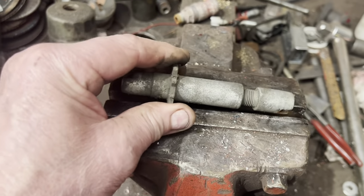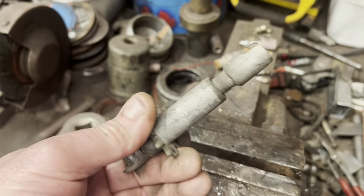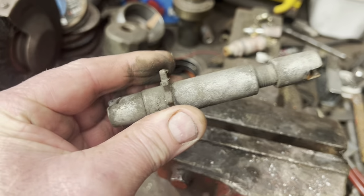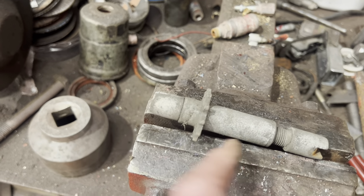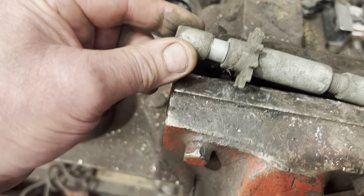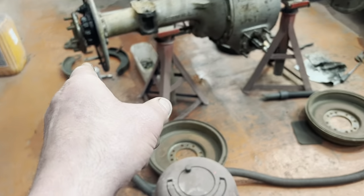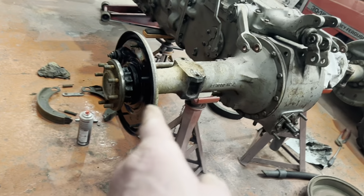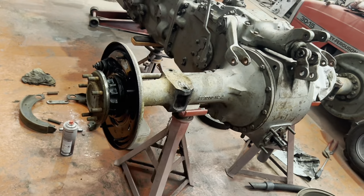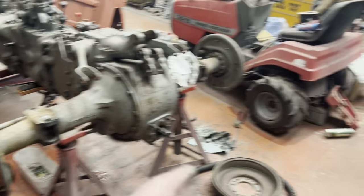So back on the 135. Well, we've been on the 135, but we got the adjuster for the brakes. We'll get that pulled apart, cleaned up, bit of copper grease in the thread. Make sure that end, well, that does turn, but we'll give it a clean anyway. We've done the other one. No, that one. So we'll do that one, and we can clean the pads up. I've painted the insides of those, so they're tidy. And then we might go put some brakes back together.